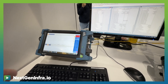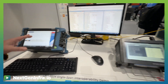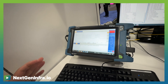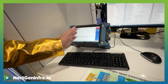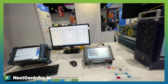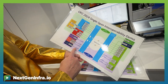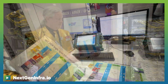I really like to show this because it's showing the actual optical spectrum of both the 400 and the 800 ZR traffic. Because 800 ZR requires that 150 gigahertz channel, we have both in a 150 gigahertz fixed MUX-DMUX. Even though it appears I'm only using every other channel, that's actually 75 gigahertz of bandwidth in a 150 gigahertz channel. That helps you see what those channels really are — lambda one through lambda eight is 400 ZR and lambda nine through twelve is 800 ZR.